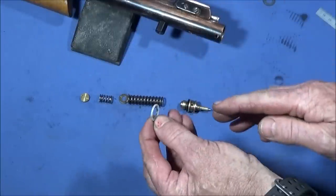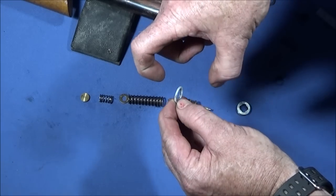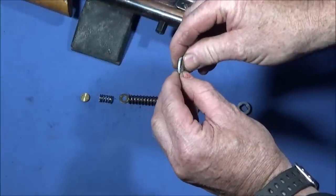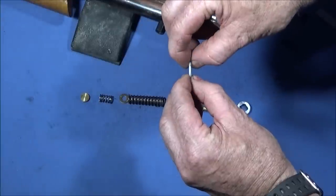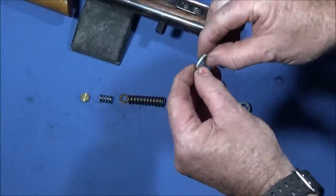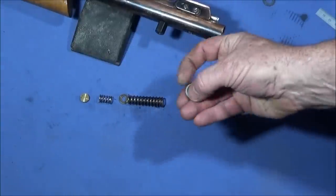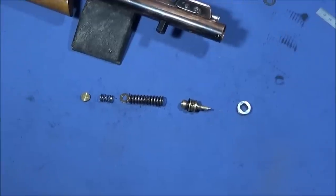But what I do is turn a piece of PTFE bar to the actual diameter over a good length, and also drill it to the bore diameter to the same sort of length, and then you can just part off 0.100 each time to make a seal, and then just carefully take the burr part off of the back with a Stanley knife, and that's the seal made. So you can actually make loads of them up really quickly and keep them as spares.